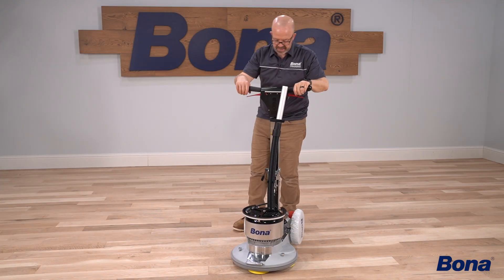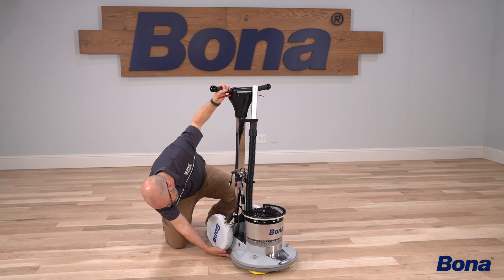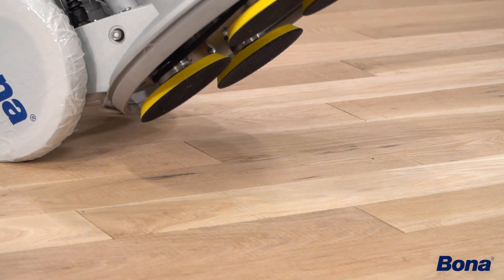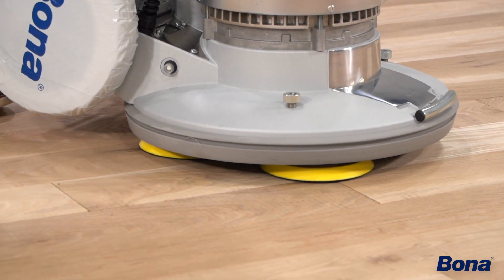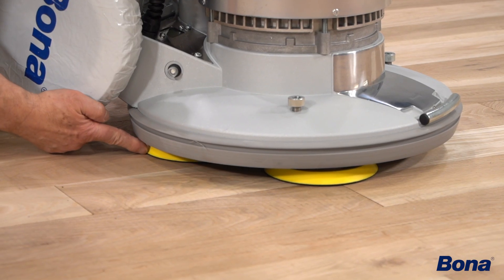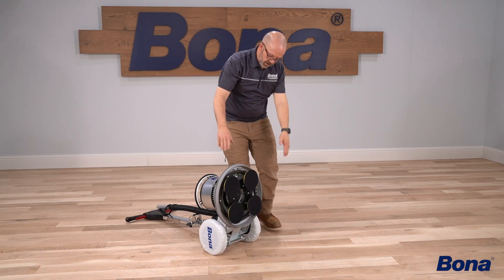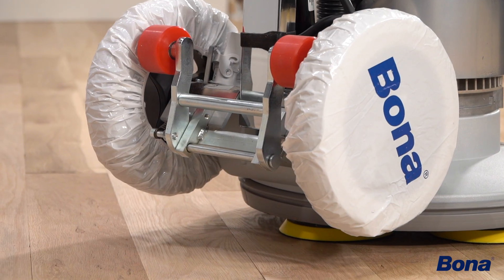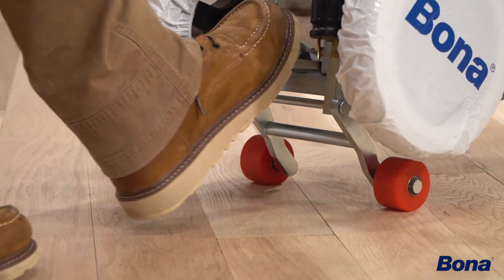If you don't have a kickstand, when you're ready to tilt your machine back, get it positioned so that you have two sanding pads sitting in the back. That way you're tilting your machine back on two pads and not just forcing all that pressure back on one. If you have your dust skirt on, pull it off and get one of your pads kind of aligned with this back wheel, then tip it back. At least you've got pressure on two of the pads and not just on a single one at the apex on the bottom. Best thing to do: just get one of the new kickstands, add it to your existing power drives, and if you've got one of the 2025 units, use that kickstand every time.